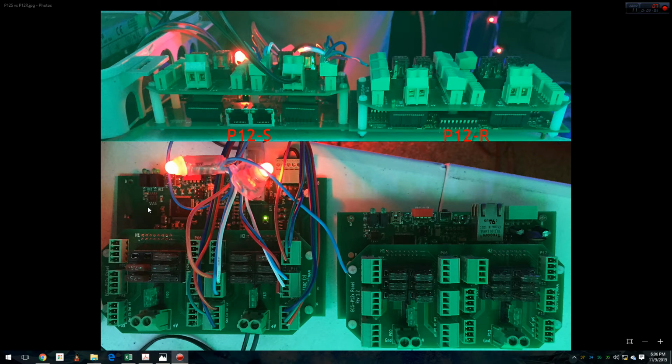Now, as far as upgrading the firmware, you can upgrade the P12S to do 24 universes now, so 2 universes per plug for a total of 24. In order to do that, you can do this a couple of different ways, but in the description I'll post a link to the hex files, the UBL that you'll need, along with a PDF guide on how to update the firmware using the UBL. So the very first thing you're going to need is that set of files.